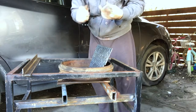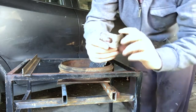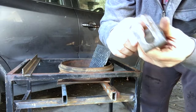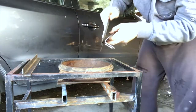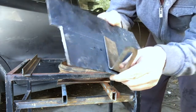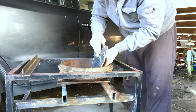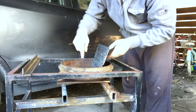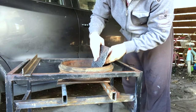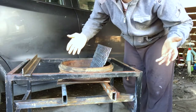So we've started making these little brackets. You can see there — basically it's a piece of steel that we've bent and then cut out pretty roughly, with an area for some screws to go in. That's going to go on the back, basically like that. That way, we don't actually have to weld everything together. And this is cast iron anyway — these are going to be very difficult to weld anything to. If we can get some screws in the back, we'll be able to take these off and put them back on as we like. Or at least, that's the idea.